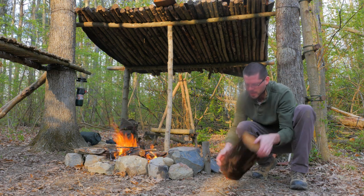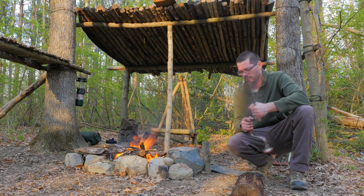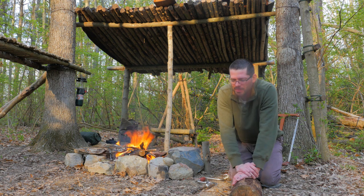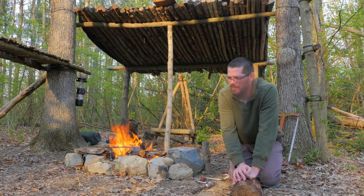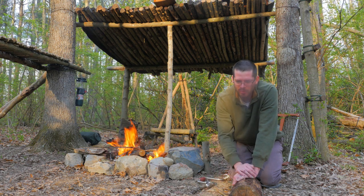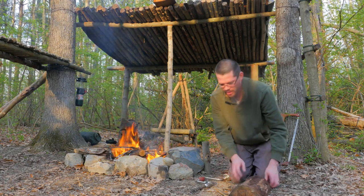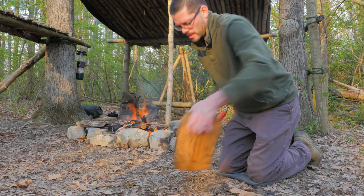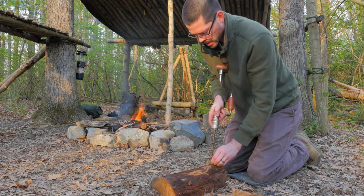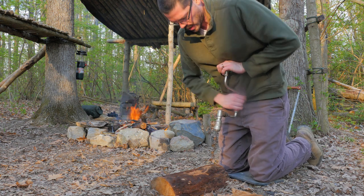The next step is going to be to flip it over and start drilling some holes. I think I'm going to do three legs, because for something that's going to be moving around - this little table thing - three points will always connect to the floor. If you've got four legs, it's always going to be wobbly. So three, I think, will actually work better. First hole I'm going to do right here, and instead of just going straight down, I'm going to angle it out a little bit. Try to find center, put some body weight on it, angle it out.